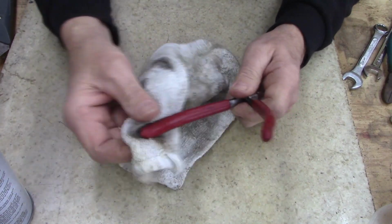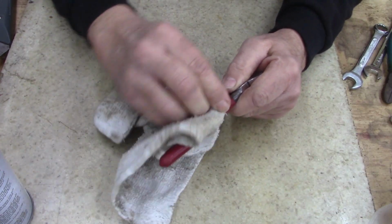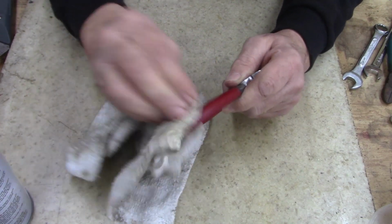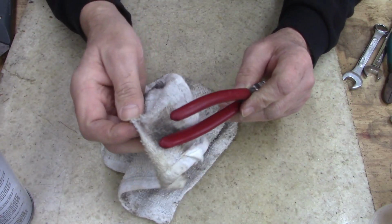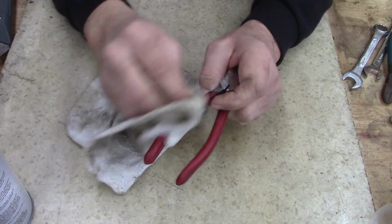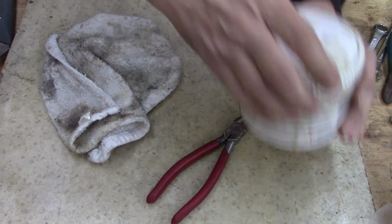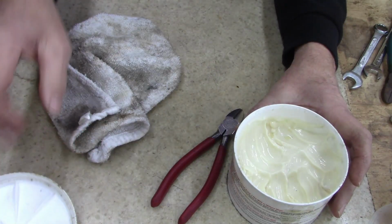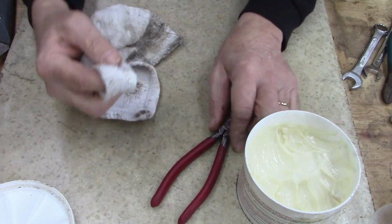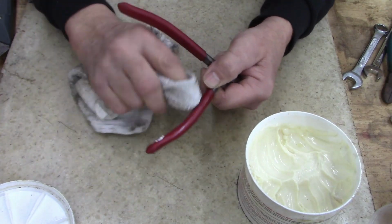I wasn't sure if the door would pass, because instead of a lead-lined wood door, I put up a steel door. But the physicist came out and passed it. I was pretty sure about my walls and my outlets and everything. I had to wrap all my electrical boxes and all my electrical light switches and stuff with lead. Now that's a trick. And somebody's going to say, well, you can just buy them. Well, you know what? I live in a rinky-dink community in a rinky-dink state of Oklahoma that doesn't really have a lot of that kind of stuff around. So I can make it if I have to.